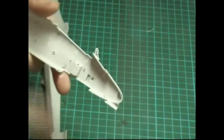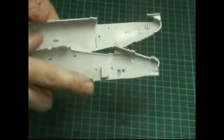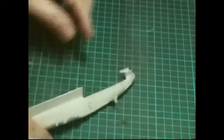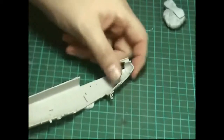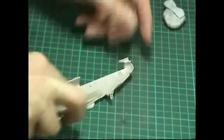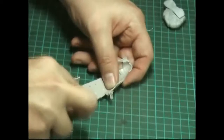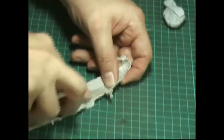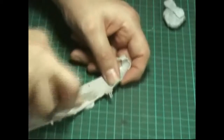Basically it's going to sit in here, lining up with this top area and just slide in like so. We still need to take this front panel out which we'll do in a moment. The locating tabs need taking care of - there's one long bar which you can see here. I've already taken it out of this one. The simple way is to keep it flat, put a blob of blue tack on your bench, place it on top, and then sand the ejector pin marks flush. Just rub it on a coarse file, wiping it on your jeans now and then to clear the file.